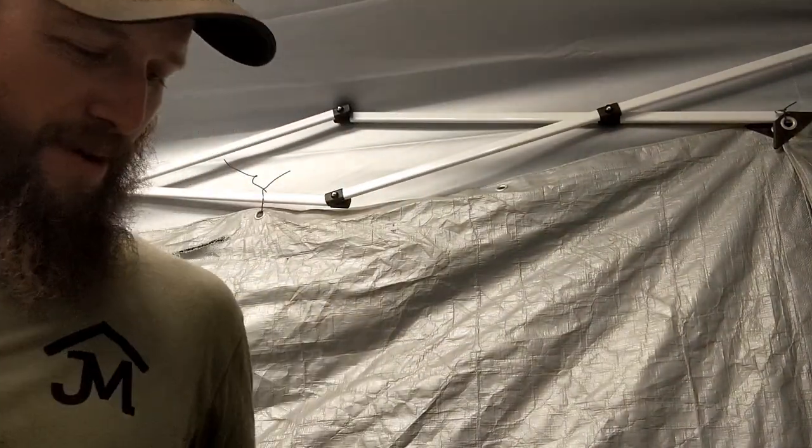I got to reading, though, in my repair manual, and it actually specifies in the manual to ream these between 0.7 and 1.4 thousandths oversize of what the wrist pin is. So it wasn't the wrong one. These are just intended to be reamed to size. I've told people that I had to ream these holes out several times, and it always makes people chuckle.